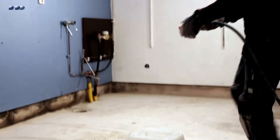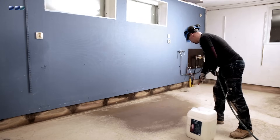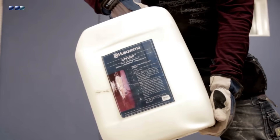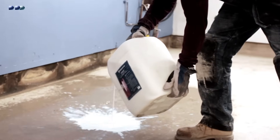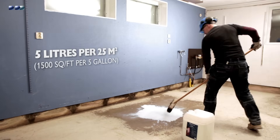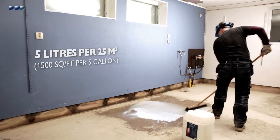Combine the grinding process with GM3000 filling compound as follows. First, wet the concrete with water. Second, apply GM3000 to the floor using a broom. Approximate usage should be 5 liters per 25 meters squared depending on the porosity of the floor. Begin with 5 to 10 square meters only in front of the grinder to prevent the GM3000 from drying out.